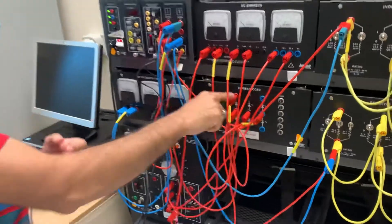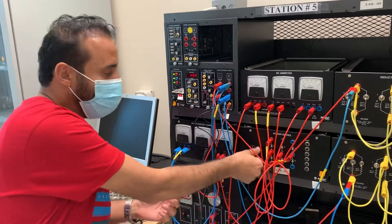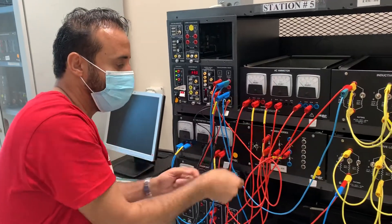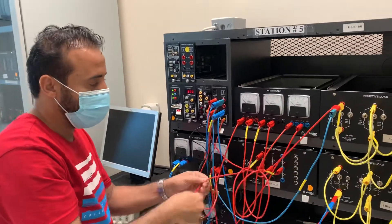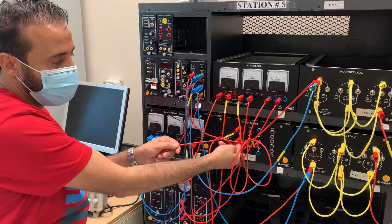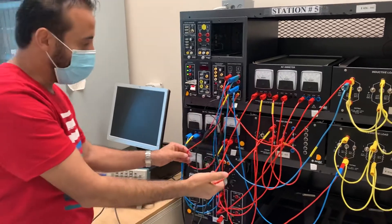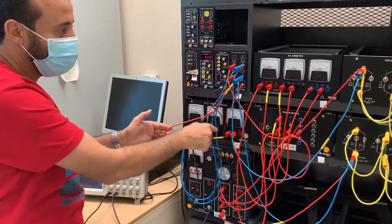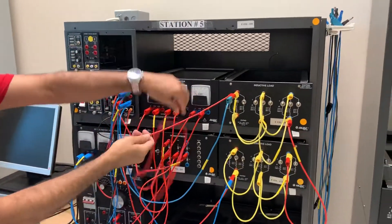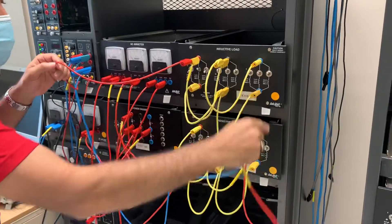We close the switch between the diodes and bring wires out accordingly. From the AC meters we go to the anode side of the three power diodes, then out from diodes one, two, and three to the DC meter, then out from the DC meter to the current isolator, and from the current isolator to the load. Let's do the resistive load by itself first.